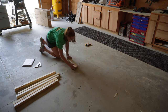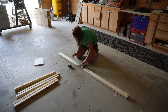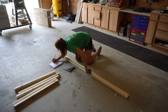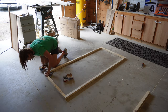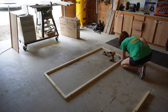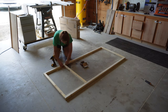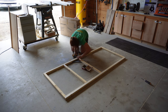You might ask why I do that — because I didn't measure one time and went with the measurements the manufacturer said the hole was supposed to be, and it was not right. So I said never ever again will I do that. Right there I put my two side pieces together and used my square to mark where the middle pieces needed to go, the same on each side. Then I start with my top and bottom piece, make sure it's square, drill a pilot hole, and put two screws on each side just to be safe.